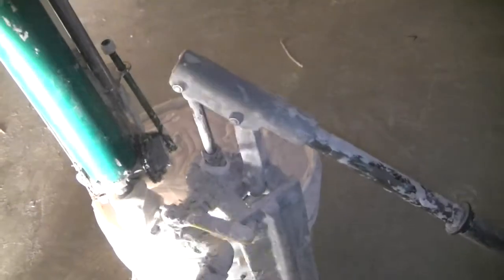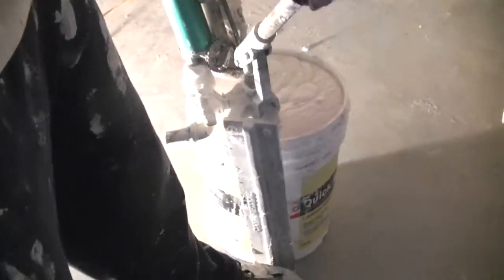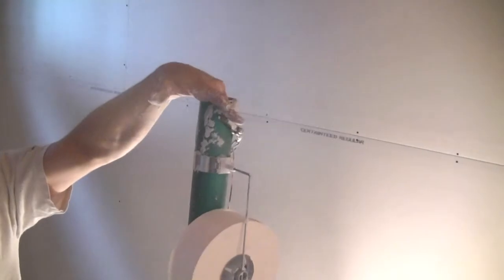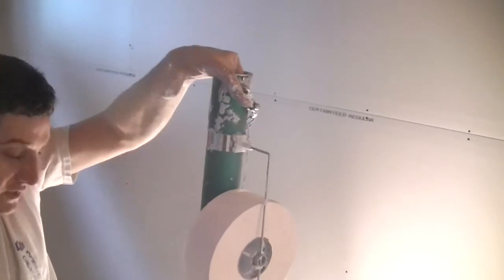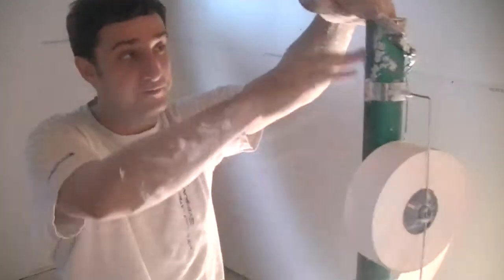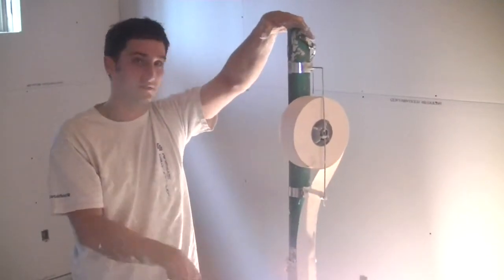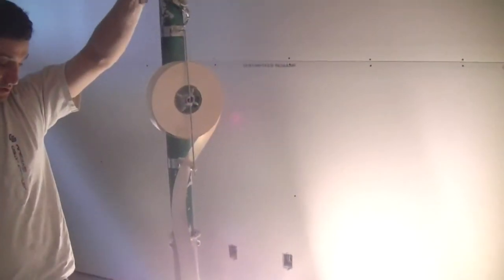So you should have seen that. This bazooka takes about 13 pumps to fill it up. You never ever want to overfill your bazooka. We put the hand at the top of the bazooka here, and we want to feel for the thing that fills up in here. The bazooka fills up with a little round plastic thing, and when you feel it hit your fingers at the top, you stop filling it up — because if you fill it up too much you are going to break the wire that is inside.